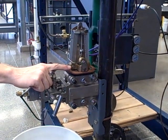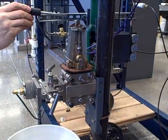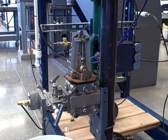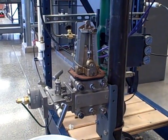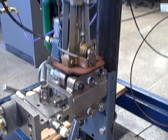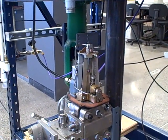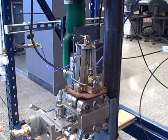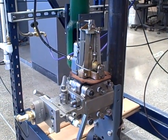Foxborough does make a kit you can bolt onto the transmitter called a suppression kit that adds additional tension to the top of the range bar. But that suppression kit — we don't have too many here in our lab, and they can be kind of hard to find, usually with lead time when you go to order those kits. So we don't have enough suppression kits here to handle large suppressions. In order for your lab team's process to work, you're going to have to make sure your amount of suppression is a fairly small percentage of the overall span of your liquid level measurement.